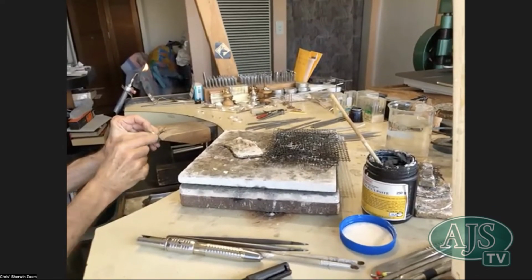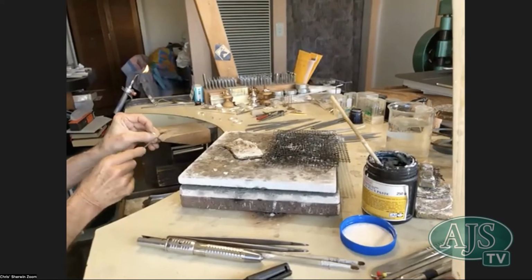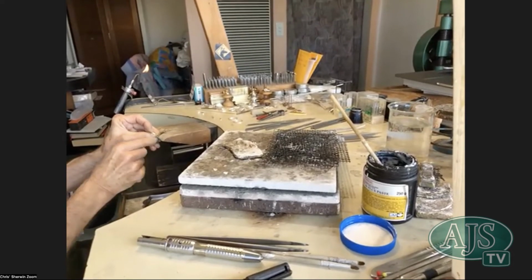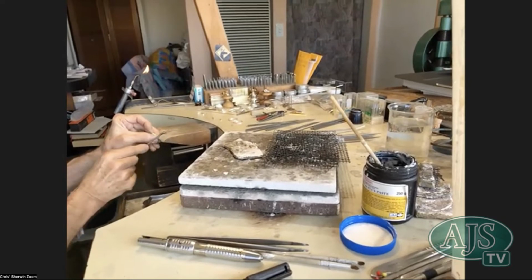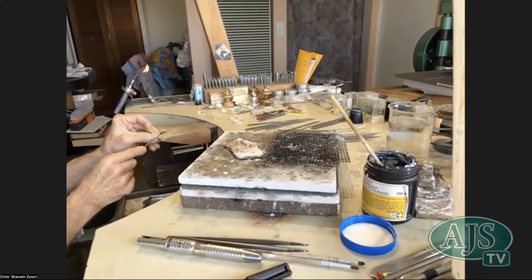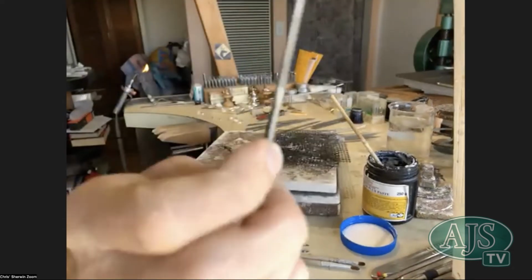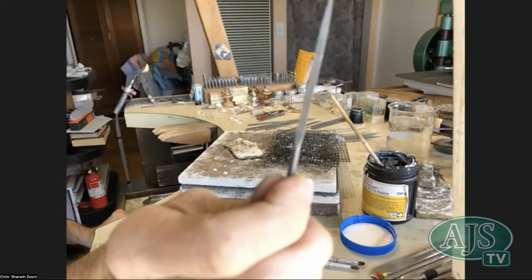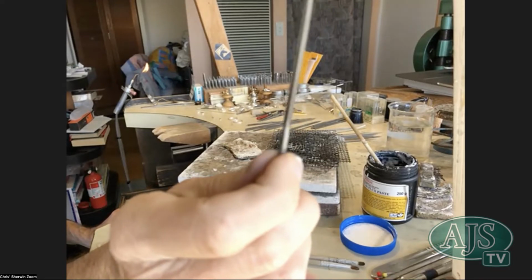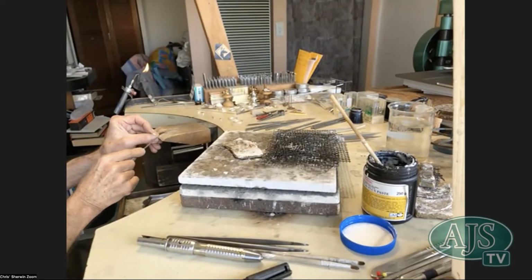So you would do this on an expensive job. You really take your time, get this spot on. So, use your escapement files, use your triangular one. I've got several triangular escapements. I've got a safety edge I've ground onto this one. So I physically ground the edge off. You can take your needle files, and so that's a ground edge. And then I've got two edges that have the coarse cut on them, and it allows me to get in very, very close to my jewelry to get a very sharp finish.